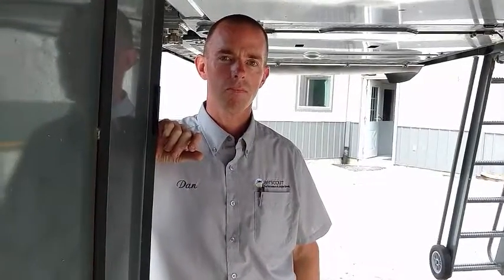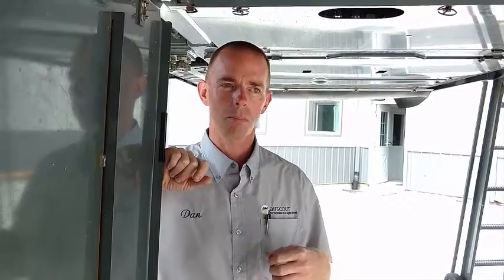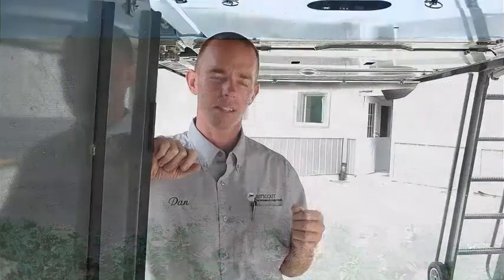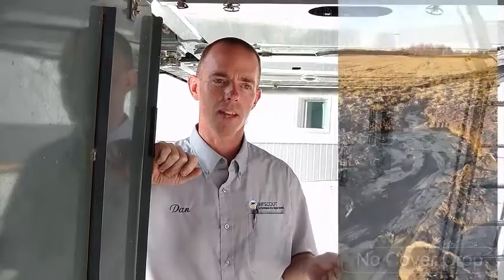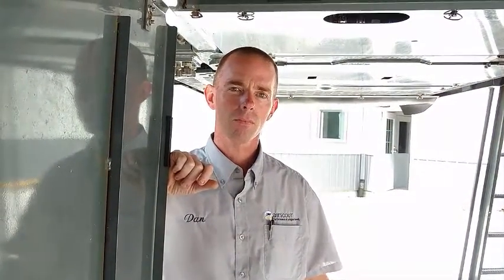We were talking earlier about your unique problem as a farmer on yellow clay soils after soybeans — that's where you need the most residue. What we've tried to do is build a 120-foot boom so I can follow my existing sprayer passes and not run down any more beans. On highly erodible clay soils, my biggest problem is erosion in the fall and spring from rain. My target is to get a cover crop growing into my standing soybeans prior to harvest, to eliminate that erosion and gain the benefit of additional growing time going into the fall and next spring. In my experience, seeding cover crops into soybeans is very sketchy because your timing has to be perfect.